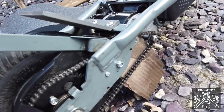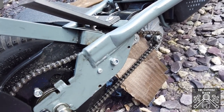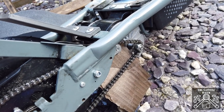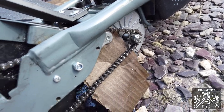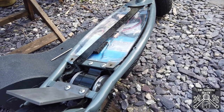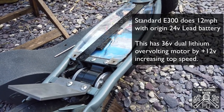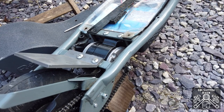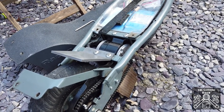With the motor in the lower position the chain guard no longer fits, so I'm going to make a little adapter on the 3D printer to fit those in place. Because it's slung a little lower, the bottom part of the chain at the front section was going to start knocking on the chain guard, so I've removed that for now. I've taken it out for a test drive — it accelerates much better than before. It still does the standard 24 miles an hour on flat or inclined ground, and it will go faster downhill or with momentum, but 24 mph is the limit of the motor at 36 volts overvolted on this 24-volt system.